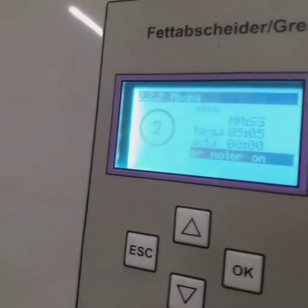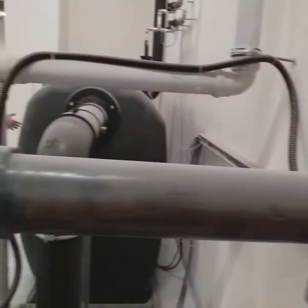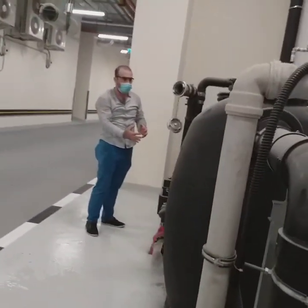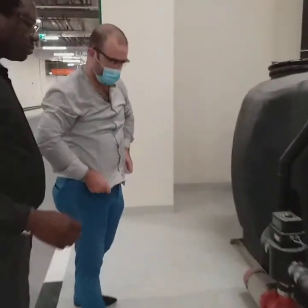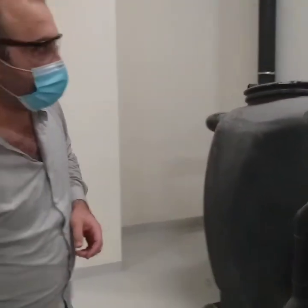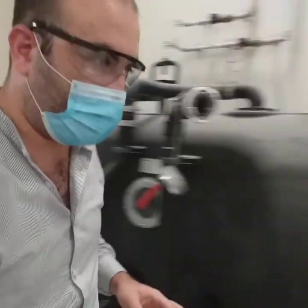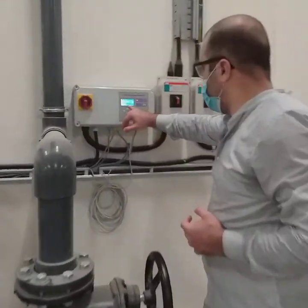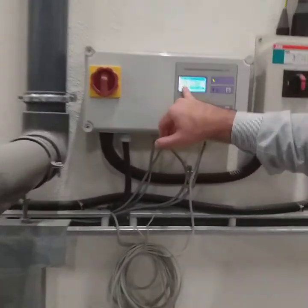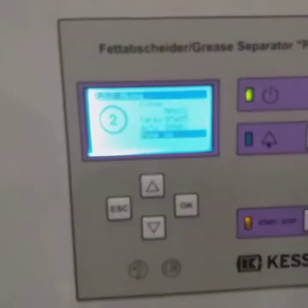You see, it stopped now, the water stopped, and now the actuator valve is moving towards the second stage, which will be the mixing. But before mixing, definitely there are several stages that have to take place. As you can see now, the second one is showing automatic actuator on, which means that now we are preparing to go to the second. Now we are starting with the mixing.